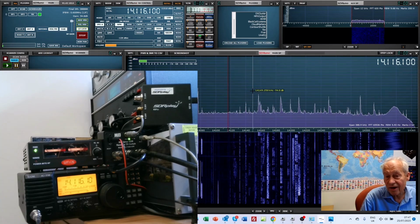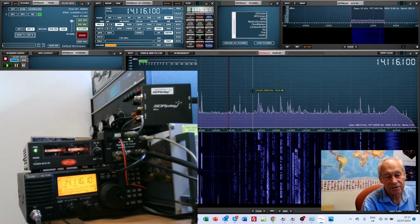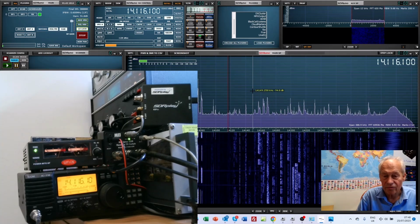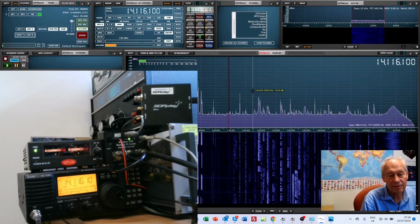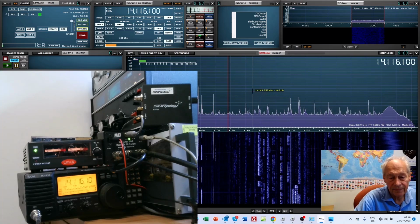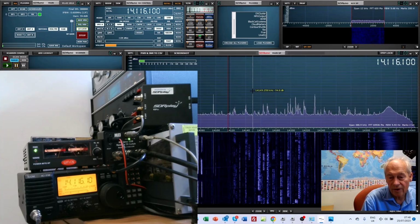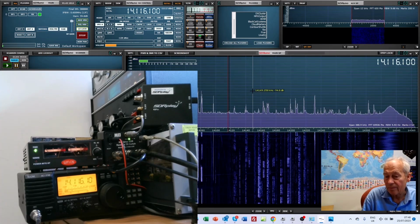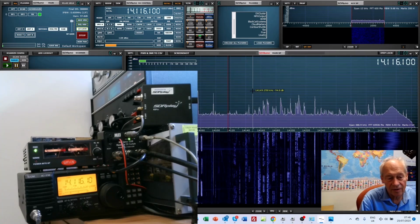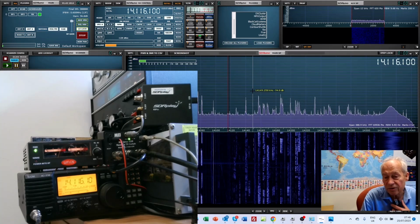So now it's time to just check out the transmit facility. I mentioned I've got a G5RV about 20 meters high at the center, and I've inserted a Capco 3000 ATU in between the linear and the antenna. For all the receive demonstrations, I've just had it on bypass mode. Obviously when I'm transmitting, I need to make sure my transmitters match to the antenna. I've just been through that process, and we're ready to operate on 20 meters.